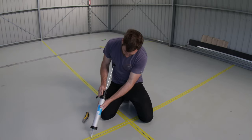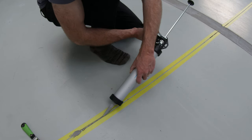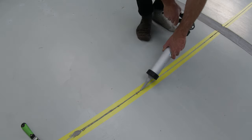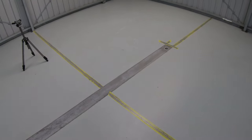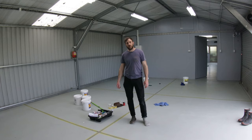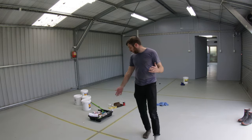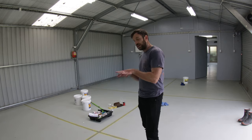So now all we're going to do is go down these joints and apply this sealant. We apply it to the expansion joints like so. And once that's done, we use our little spatula just to smooth it out. This is what it looks like after all the sealant is in. When I rip this tape off, it should make a clean line. Our epoxy filler is in.